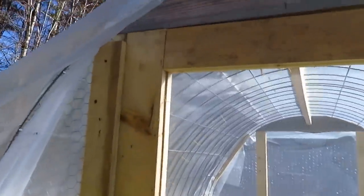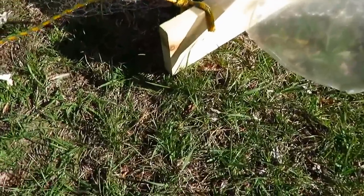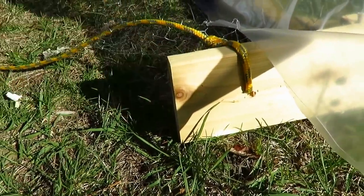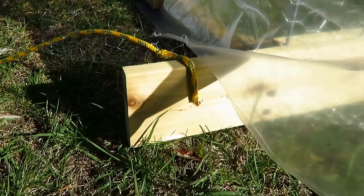The door was made the same way — I used leftover pine, three-quarters of an inch thick, four inches wide. The other big improvement I made is this one-by-six right here is cedar, not pressure treated. It's lighter, and that way you don't have to worry about the chemicals in pressure treated wood.